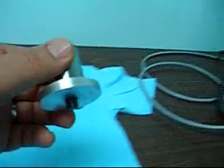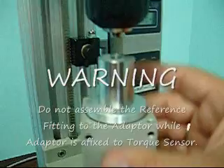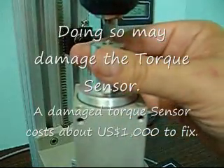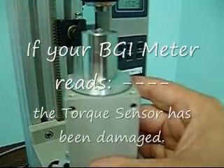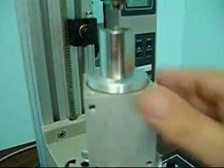You can just take this and bring it to the machine — it fits. You see there's a square hole right there, and this fits right into that square hole very nicely. Now, a word of caution: you do not want to assemble the reference fitting while it's on the torque sensor, because the torque sensor is very sensitive to manual torque. By screwing this on while it's in place, you may put your torque sensor out of calibration or even break it. So always take the piece off, do the assembly, and then put the piece on.